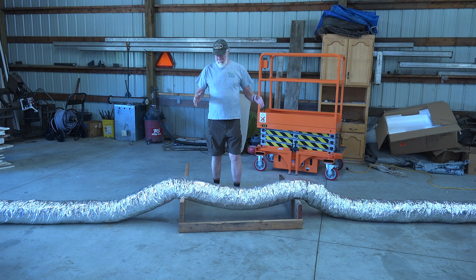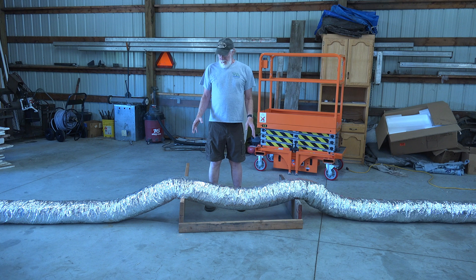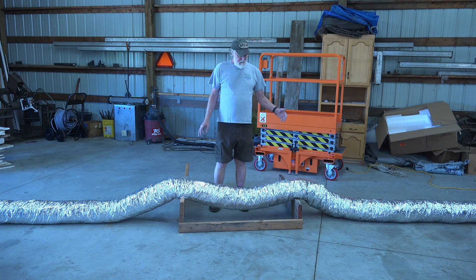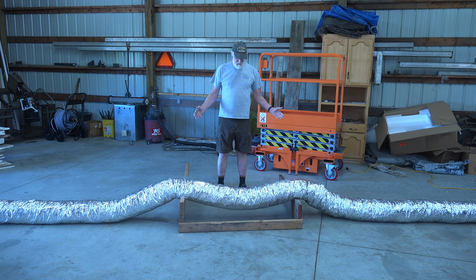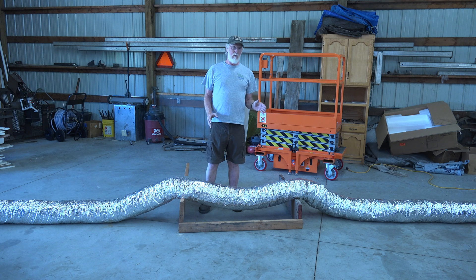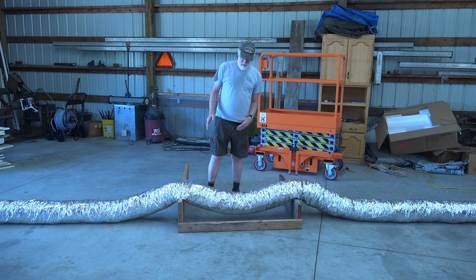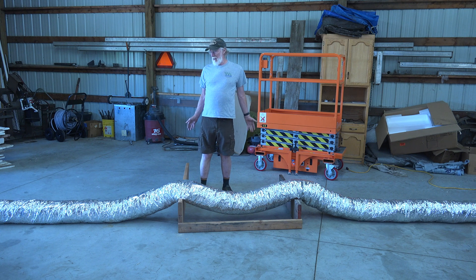What we're showing here are supports on four-foot centers — that's mostly code from what I've seen. I don't like this either. Supposedly you can sag a half inch per foot, and this is probably a little beyond that limit. Over the years this stuff is going to start squishing down. It's a little springy with the wire in there now, but if nobody ever comes up there, it's going to keep going down.